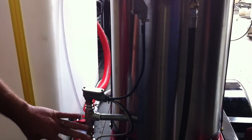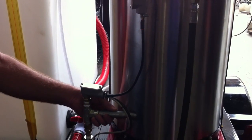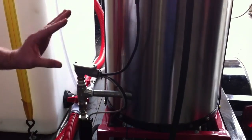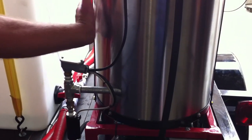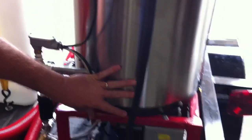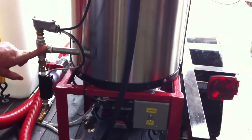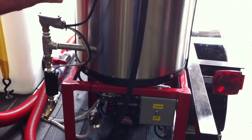With a beefy control circuit, adding an additional temperature control on the inlet of the heater means that if the water is not flowing, we have complete control over the fire. It shuts this heater off long before the temperature control at the top of the heater would go off. In other words, with the temperature control down here next to the fire burning, the heat is going to transfer here faster than it's going to transfer up here. That saves a lot of heater coils.